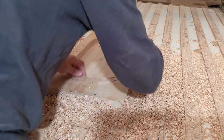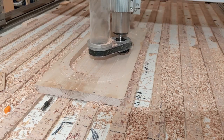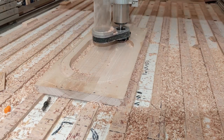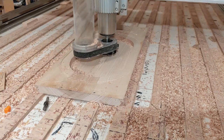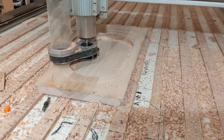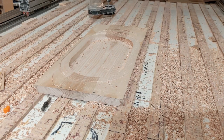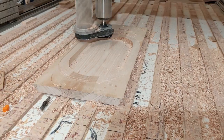The bit I use to begin with is a 12mm — you can see it lying on the router table in front of the piece. It's a 12mm single flute. And then finally to cut it out, I'm using an 8mm twin flute straight bit. So here I'm cutting it out.